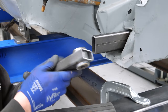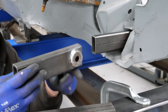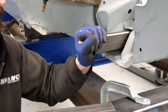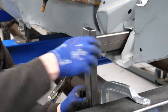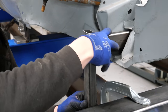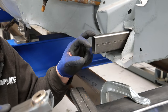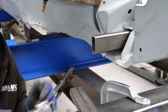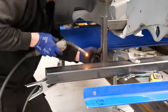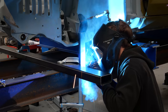What I've got here is a piece of box section with a piece of tube in it and a thick repair washer welded on either end, giving me a location point the bolt can go through — this is replicating what would be the lower control arm. I've got that bolted into the actual car, then I'm using a piece of box section to go down from the car onto the jig. When I then cut the car away and chop all this out, I've still got that fixed lower arm position to construct new stuff from. Do that on both sides, weld it on, then on to the front tie bar position.